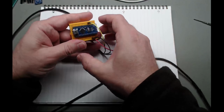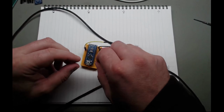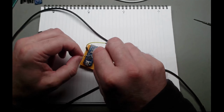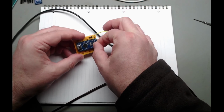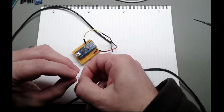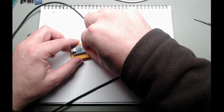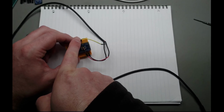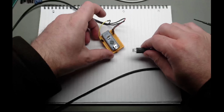So that's the basics in there, but now we need to provide the pull-up resistor. So let's go from there to over there, something like that. And then that goes in between 5 volts on that one and the pin there. Oh, this breadboard's not very good. Oh, come on. Good enough for prototyping, but annoying at other times. Okay, that's in. So as you see, we've now got the pin running between this IO pin and 5 volts, and then ground is over here. So let's plug that in.